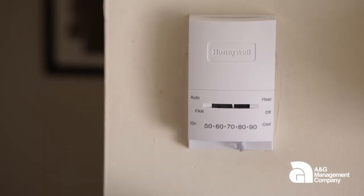One very important thing is do not turn your thermostat off. If you turn your thermostat off while you're gone for the day, the humidity level is going to build up in your apartment. If you set it between 80 and 90 degrees, it won't run very often, but it will run just enough to keep the humidity level down while you're gone for the day, which does not burn that much energy.